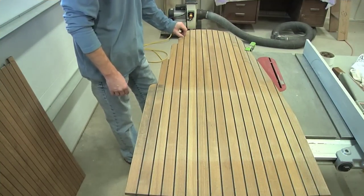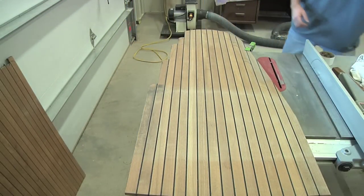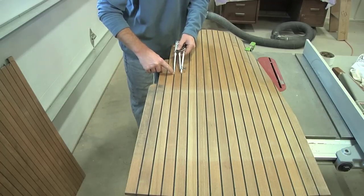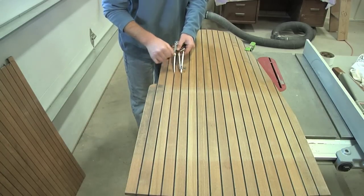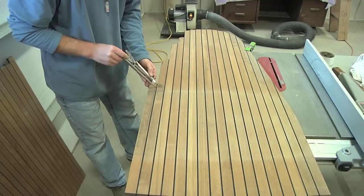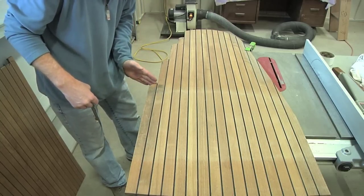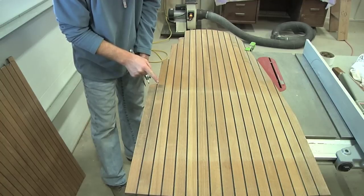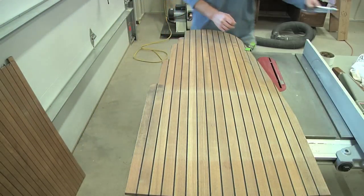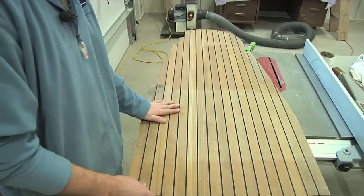The way I determined the radius is I took my compass and set it to the width of the plank. I've got the tip of one side of the compass here, and the other tip with the pencil is on the inside of the plank. When I went through and made my radiuses, the cut is starting at a 90-degree angle and coming in at a 90-degree angle — so between here and here it's a nice 90 degrees and it looks really nice. With this side done, I'm going to repeat the process on the other side and then bring it back up for another fit.